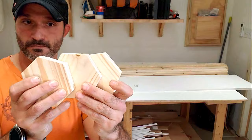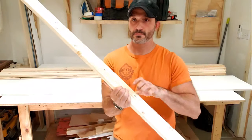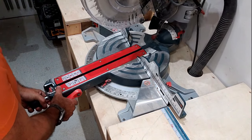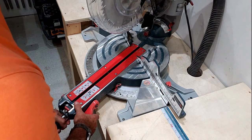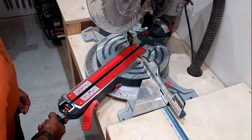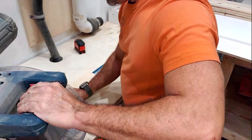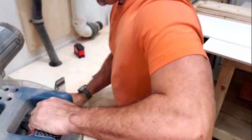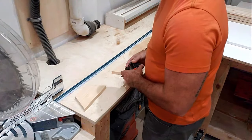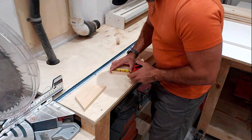The key to this project were these hexagons. I was going to need a lot of them, so I decided to make them out of 1x4 spruce that you can get pretty inexpensively. The best way to make a hexagon is using a miter saw set at 30 degrees. This is a great way when you've got to make as many as possible in a short time. I started off by cutting one hexagon — I took a scrap piece of 1x4 and cut the end off at 30 degrees.